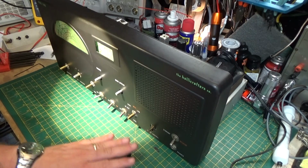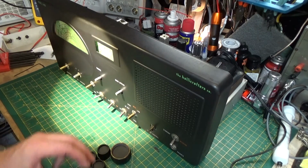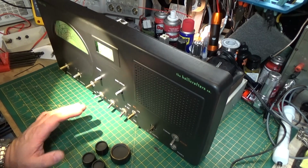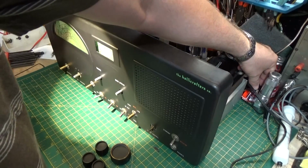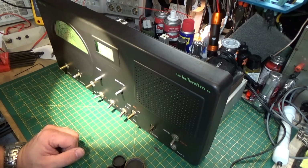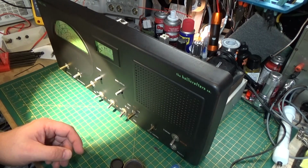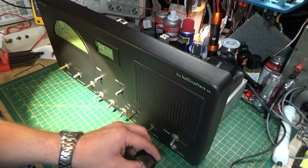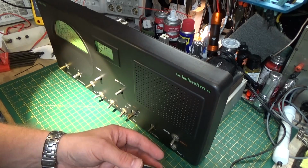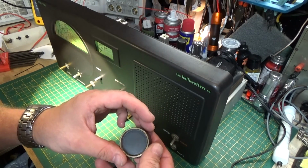Plastic knobs with aluminum coating on them, or brass plating, or painted on dots, painted on lines, anything like that, you've got to be careful, because if you soak them in anything too harsh, it'll take that stuff right off. What I found the best thing to do is get just a little pan of hot water, as hot as you can make it, tap water, put some regular old dish soap in it and soak it, then take a toothbrush. While it's in the water, just go over it, clean all of the knurls out, and you can see it actually comes out pretty good. I mean, you just go with the brush and it turns out pretty good.